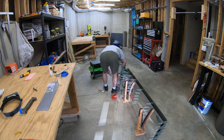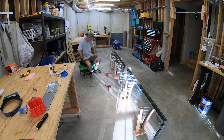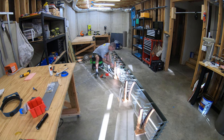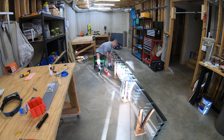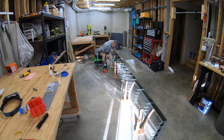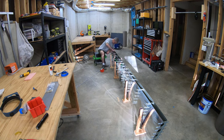The bulk of the remaining work now is to rivet the skins to the structure inside. This is done with the whole assembly still in the cradles — I've switched back to my strap-style cradles that give a little better freedom of movement and access, and I still have the whole thing on the floor of my basement. The riveting of the skins to the structure is done working from the front of the stabilizer back, which in this orientation means from the bottom up, starting with a couple hundred rivets that attach the skin to the front spar.